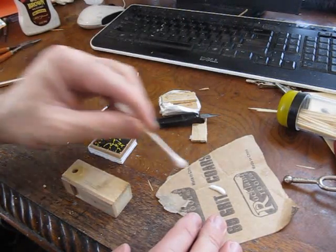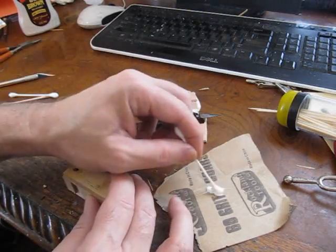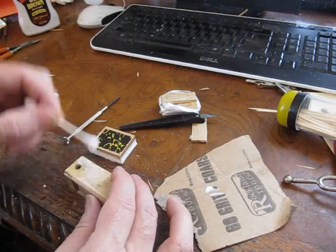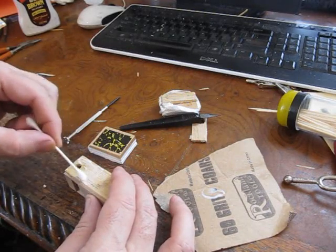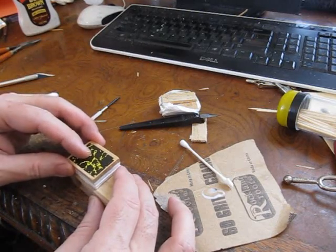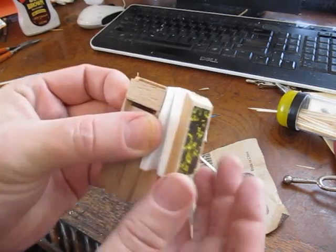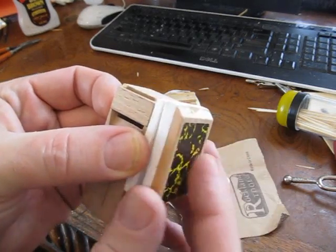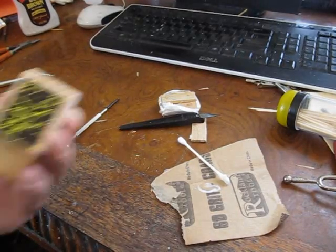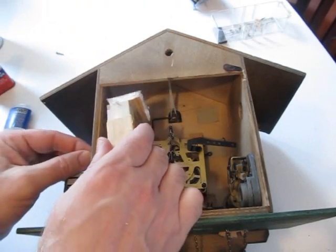While that is working, we are going to replace the bellows on the cuckoo. I remove the old one there. See around where I'm gluing — that hole? That's the bellows that forces air through the hole and it comes out the whistle on the side, and that's what makes the cuckoo the 'oo.' I actually bought one in the black forest in Germany many many years ago and I still have it, though it still won't run well. That clock has been running well for hours, so we are going to put it all back together and finish it up.